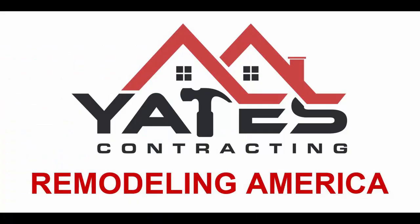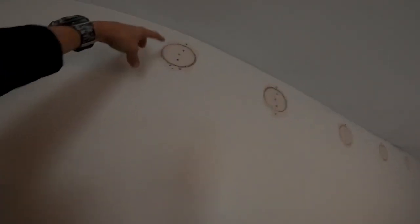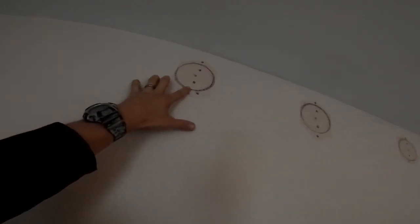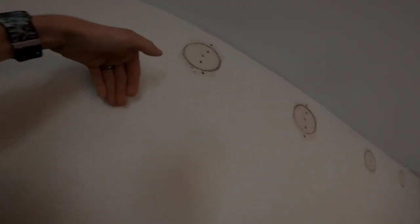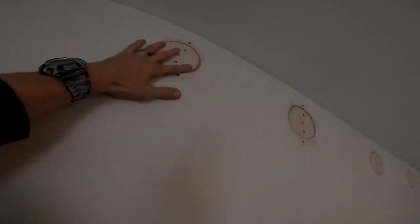We're doing a semi loose-fill, tight hard-fill cellulose insulation in the walls. We drilled about three inches down from the top of all the bays in the wall — roughly a four-and-a-half inch hole all the way across the tops of all the walls. This gave us enough room to get our pipe in. We stuffed it about a foot down into the walls, filled it up nice and tight, then filled it right to the top.